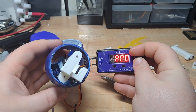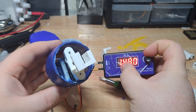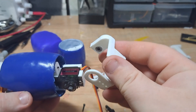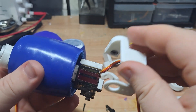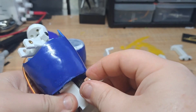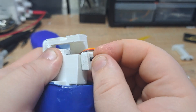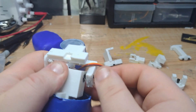For the servo's position, it uses something called PWM, or Pulse Width Modulation. This little guy is capable of pumping out a precise PWM signal. 1500 is usually the neutral, and the highest and lowest numbers represent the most clockwise and most counterclockwise positions. It's definitely better to have your servos preset before you install your final components. I'm also showing these bearings in the design — originally they helped deal with stress so the servo didn't have to work as hard, but when I screwed them in place it actually made it harder for the servo to move. So I'll probably have to go back and adjust the hole, or maybe not at all, since the servo seems to work just fine without them.